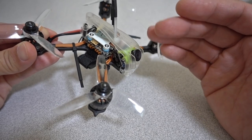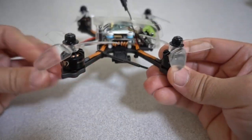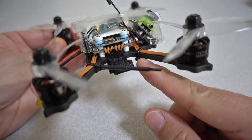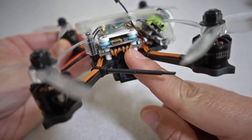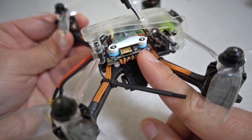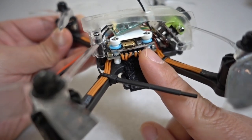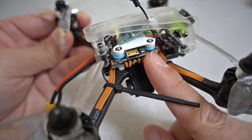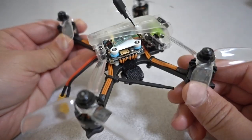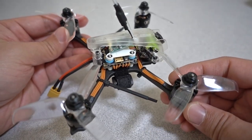I'm not sure who is doing their tuning over there. They say they're doing black box tuning, but I have a theory: it seems like their tunes are not that great, and I think what's going on is they are screwing down the stack too tight, so the vibration dampening is no longer effective. The F4 flight controller only has an 8K gyro — the MPU 6000 — which shouldn't be affected by noise as much as a 32K gyro, but because the silicone grommets are smashed down so much from the tight screws, I think that's affecting vibration dampening. Basically the grommets aren't effective with the screws tightened down so much. I flew it just as it came out of the box — this one came from Banggood.